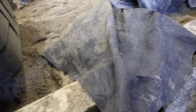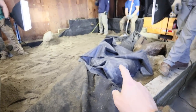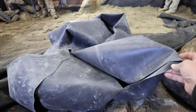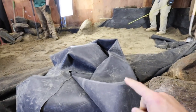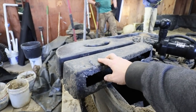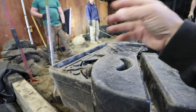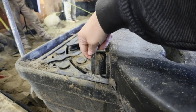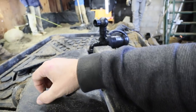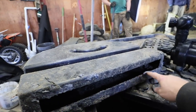Some of the other materials we're using: we have this non-woven poly fabric to protect our liner. Once the excavation happens, this goes in first, then we're going to use our 45 mil EPDM rubber liner — really flexible, molds into the shape of the excavation nicely, and tough. This is what's going to actually hold the water into the water feature. To start our waterfall, we're using something called a pondless spillway — basically a diffuser so the water comes into the back, goes into a chamber, and gets spread out evenly across the whole face.